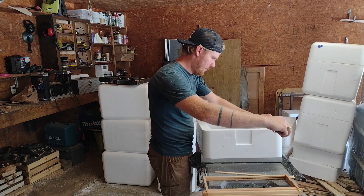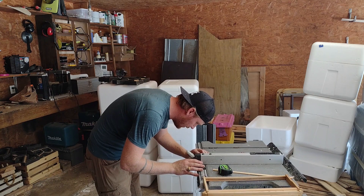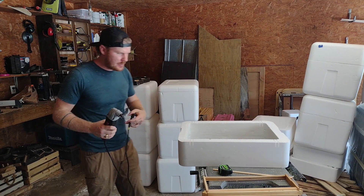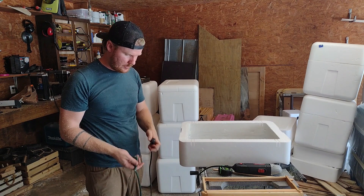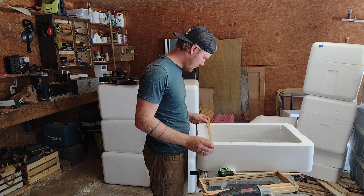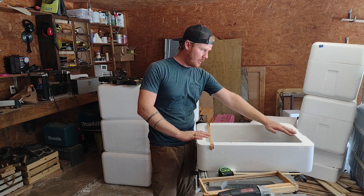These frame holders are each three-quarters of an inch, so now I'm moving my fence to three-quarters, compensating for the blade width by moving in a sixteenth. Then I use the oscillating multi-tool to cut out those grooves. Let's see if it fits — beautiful. It fits down there in the groove. I'll put the other one in after I finish cutting out those tabs, then test it to make sure the frames sit in there nice.